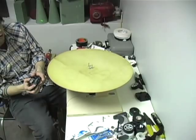The biggest challenge with this build is making the little RC motors spin around 2-4 RPMs when they want to spin around 2,000. After a lot of trial and error, the solution was to use wooden wheels found in the trash as a type of flywheel, and then wire in a rheostat.